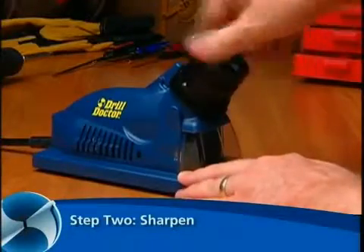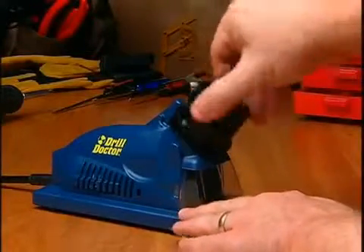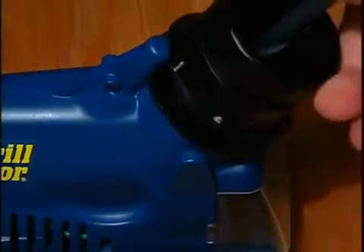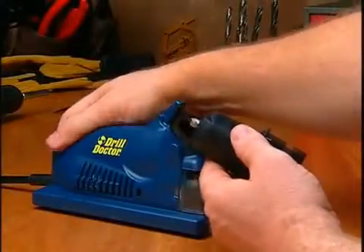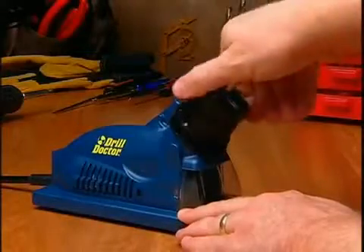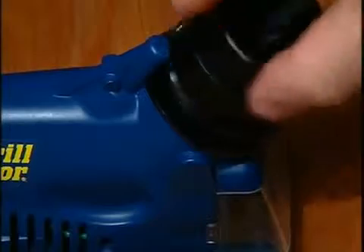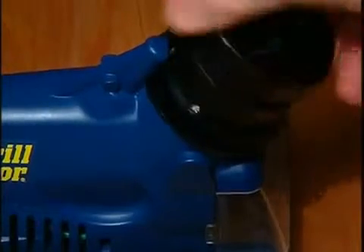Step 2: Sharpen. Insert the chuck and align the white line with the cam guide. Now rotate the chuck one half turn in a clockwise motion — turn white line to white line an even number of times. About 6 half turns for a quarter inch bit and 16 to 20 turns for a 3/8 inch bit. Remove the bit and inspect the tip. When sharpening, listen carefully to the sound your DrillDoctor makes. Note that you should direct light pressure into the sharpening hole, not down. Always make sure the chuck rests firmly against the cam guide as you turn the chuck — this causes the sharpening port to rock back and forth and shapes your bit for the best cutting.